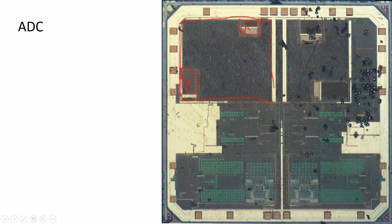So, much the same on this side here, the second channel laid out similarly. It's not quite symmetric, because I suspect there's over here some of the utility functions on this side of the chip coming down here. Anyways, ADC converter, of course, also more than just simply a converter now. Doing a lot of signal processing before it gets passed into the main SoC.